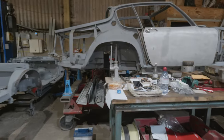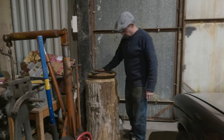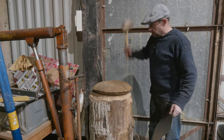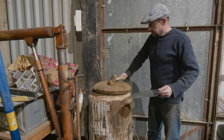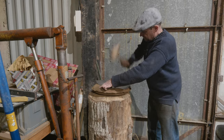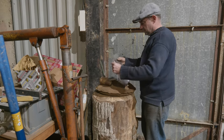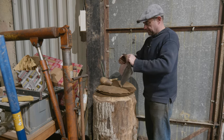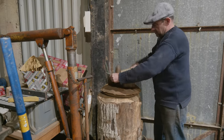Right, so we use it on this sandbag here. Sandbag there, that's it, on a nice bit of oak. We use a sort of egg mallet for doing that with. Right, so you see we're getting the beginnings of the shape. You see how it's puckering up like that.